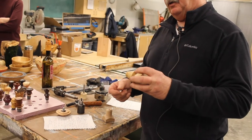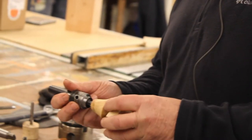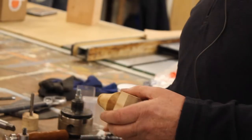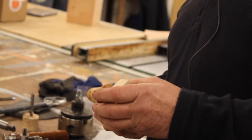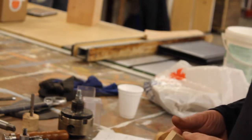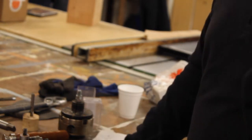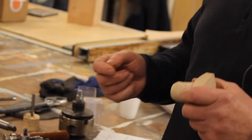This I used in the headstock, in the chuck — just shaped it like this, and then when I get past that I thread it onto here. Then you can cut this off and do your finish. But you can also finish it just in your chuck, depending on the shape you want. The blank is two by two by two and a half. The drill hole must be square to the stopper, so you want to keep this square when you use it on the drill press or drill a hole from your tailstock on your lathe.